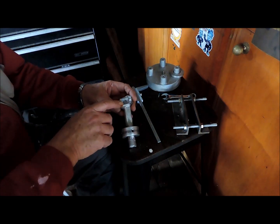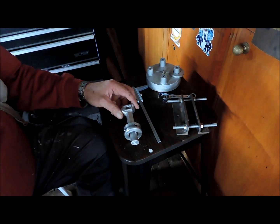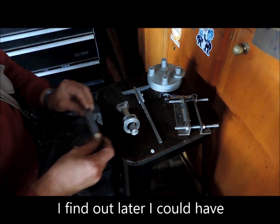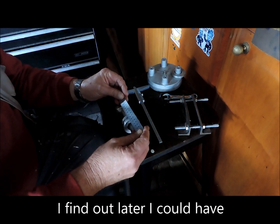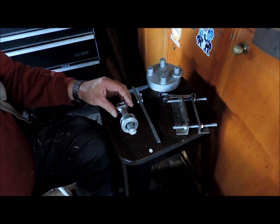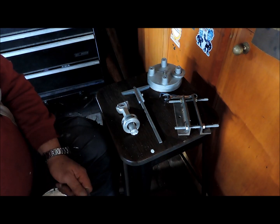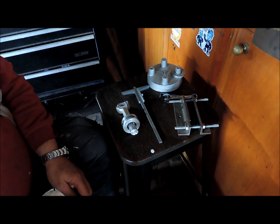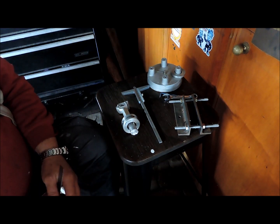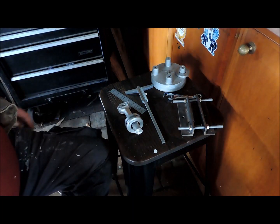So I've got the hole in this end here, now I need to run it through — that's going to be interesting. I can't do it on the milling machine because I need... let's see, that's about 110, 115 deep. Which means the drill has to be out here 115, there's 250. The mill is about 150, so I'm a long way out. Might be able to cheat and fit it on the lathe — I've got about 270, say 250.